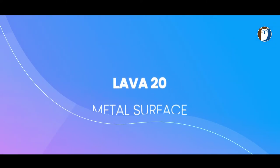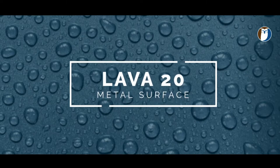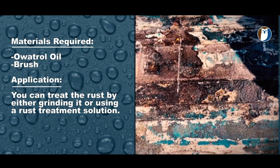Lava 20 on metal surfaces. Step 1, surface prep and treating the rust. Step 2, priming. Step 3, taping any joints, cracks or holes, etc. Step 4, waterproofing. As you can see from the photograph here, the rust is quite substantial. With this, we recommend treating the rust.